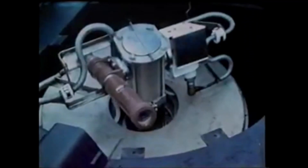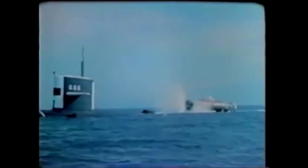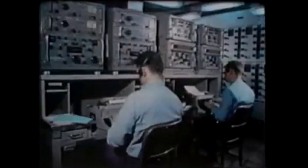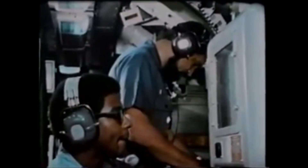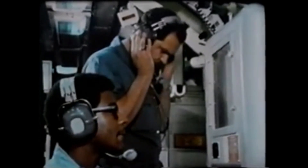Now it all comes together. Part of the mother sub's special equipment are TV cameras, which observe the DSRV when it's piggyback on the sub. Once loaded, the mother sub and DSRV head for the search area. On the surface they proceed at speeds limited mainly by the sea state, or they may move at 15 knots submerged. When the DSRV arrives at the scene and the search force narrows the location of the distressed submarine to an area six miles in diameter or less, the rescue operation shifts to the localization phase. Sonar men on the mother sub are listening because the crew on the dis-sub are also active in their own rescue effort, helping the localization phase with distress pingers, underwater telephone, submarine sonar, and just simple hull tapping.